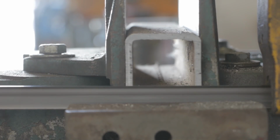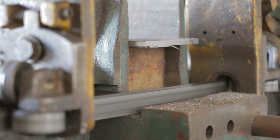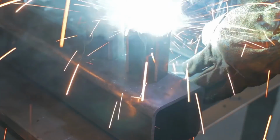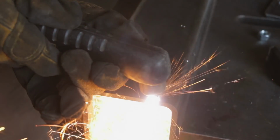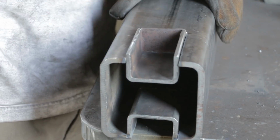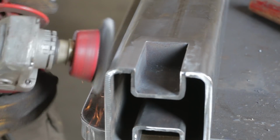The bottom plate I'm gonna bolt to the concrete floor, and I really didn't want the bolts sticking out a lot wider than the post. I thought it could be a bit of a tripping hazard, so I decided to recess them halfway within the post. But I still wanted it completely closed up, so I made a couple small enclosures that I could notch out for and weld into the tube, which would let me do this. Once I got them welded, I worked on blending them too.